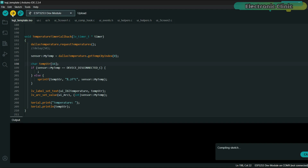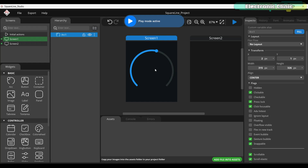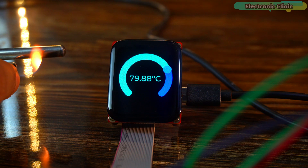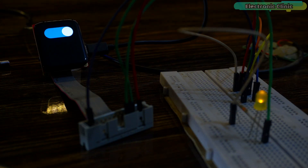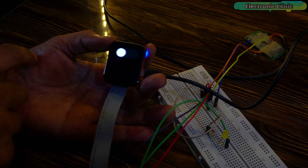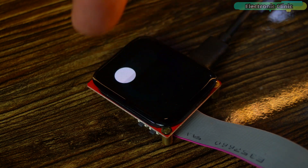Let's go ahead and upload this program. When I run the project, I see the temperature being displayed clearly both as a label and visually on the arc gauge. During the UI design in SquareLine Studio, I made sure to uncheck the Clickable flag for the arc, so now when I touch or swipe on the arc, it doesn't rotate or respond — exactly what I wanted since the arc is just for displaying temperature, not for interaction. When I swipe over to screen 2, there is a switch that can toggle to control a load. Right now it's turning an LED connected to GPIO21 on and off. When I turn it on, the LED lights up; when I turn it off, the LED goes out. Instead of the LED, I could also connect a relay module to GPIO21 to control an AC or DC load like a fan, lamp, or any other load. The whole interface feels responsive and functional.